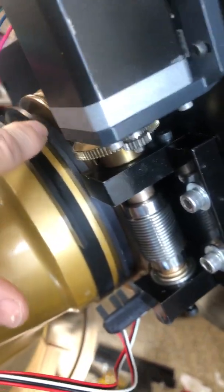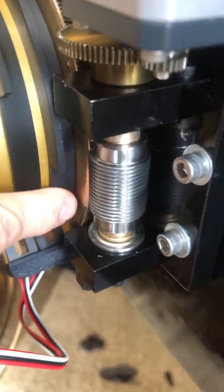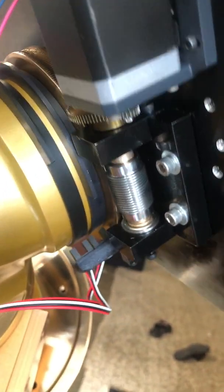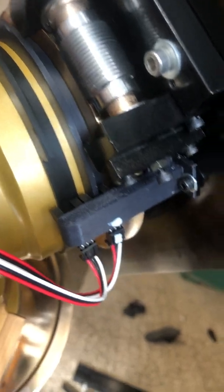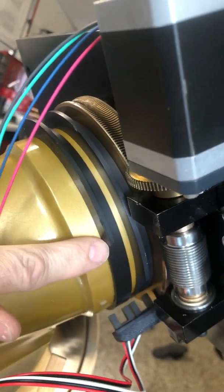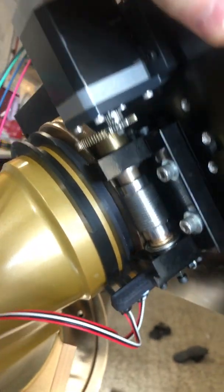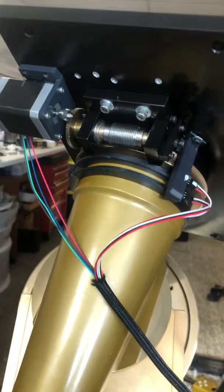And then how it works is, for the homing, I just 3D printed a ring. Half of the ring has a groove, the other half has no groove. So when you tell it to go home, if it's on the no-groove side, it knows which side to rotate to, and it rotates until it hits the groove, and vice versa. The second one here is just a limit. Again, I can move this ring wherever I want it. I just have it set here for testing, but there'll be a groove set for the two max limits. That's just a hard stop, so if it hits those, that cuts out any of the tracking and everything. That's a feature of OnStep that I hadn't used before, but it really seems to work very nicely.